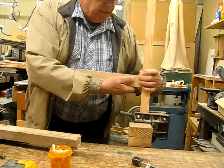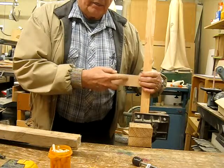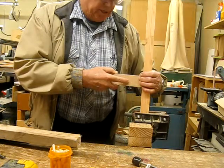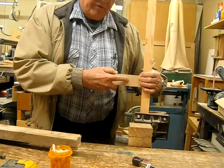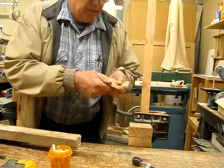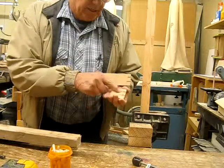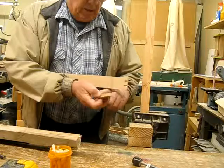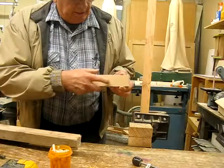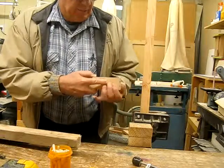It's easily covered up with a little bit of colored wood putty. And then after you've done this, of course you can go ahead and refinish the new stretcher. I hope this is clear enough so that you understand what's going on. After the bandsaw has cut this, I wouldn't even bother to sand this or anything, because it's going to fit really nice. Just a tiny little bit of touch up here with some sandpaper and a little sanding block.